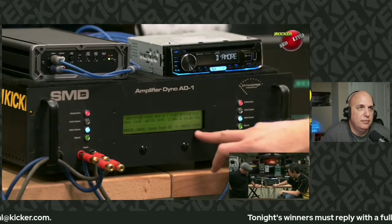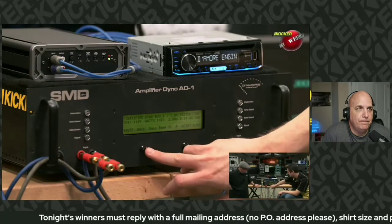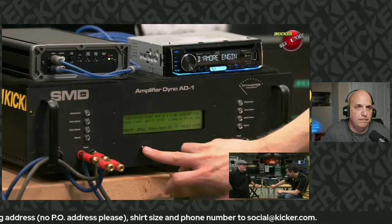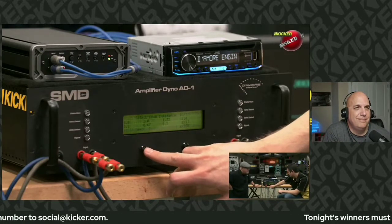1149. Pretty consistent. Yeah, but we're low on voltage. We're 4/10 low on voltage. So if I had 4/10 more, you'd probably be right at 1200 watts. So this particular sample is pretty darn close. And again, that's a small amount of power you would never audibly hear. Yeah, 50 watts. But still, we wanted to make sure that it would do rated at 14.4.